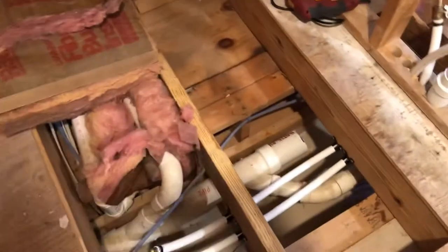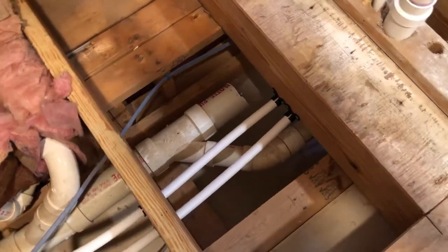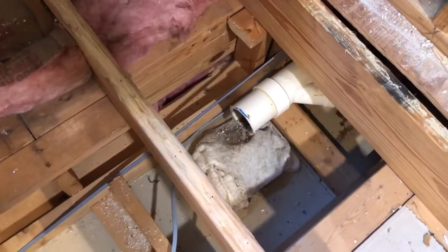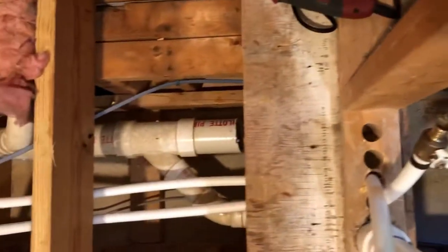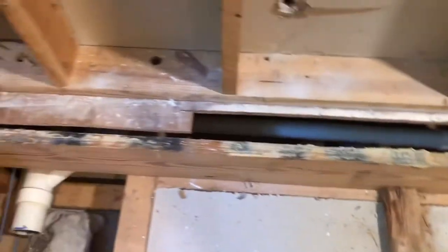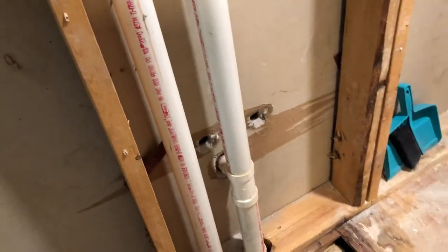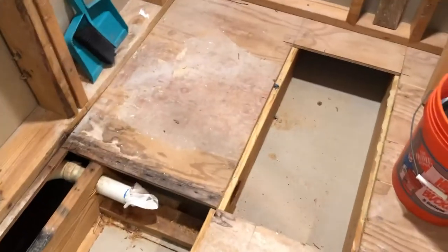I think that was the quickest part of this whole job. Now I've got my 3-inch line open right there, which is draining to the left. Now I've got this void all the way over to the other 3-inch line here. In between this one and the one down here, that's where I'll have two inlets - one for the toilet, and another 3-inch that will be for a vanity going here, the sink in the other bathroom, and the shower, which will go here.